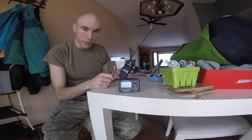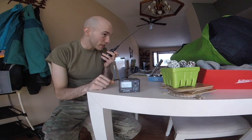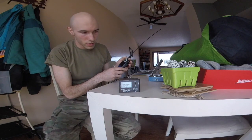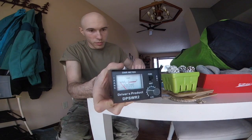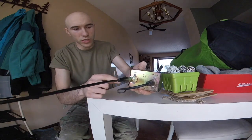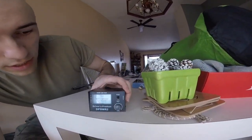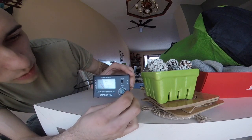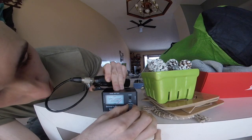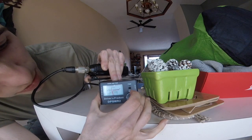First, on the frequency I designed the jungle antenna for, I announced: 'Any station in this net, this is Kilo Lima 5 India Foxtrot, I'm going to be doing some antenna SWR testing.' This is my cheap SWR meter — the back has an antenna and transmit side, hooked up with SMA adapters for the PL-259 connectors. Setting it to forward mode, I hold transmit, rotate the knob to the set mark, then switch to reflected — the rubber duck antenna came in at about two and a half to three.